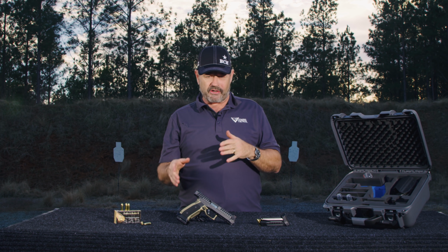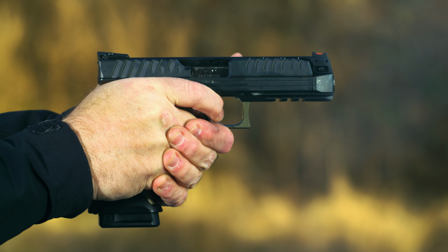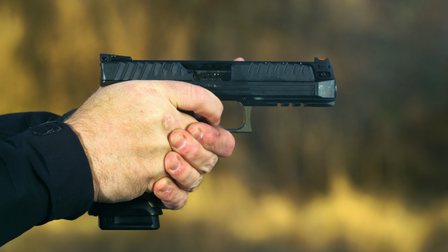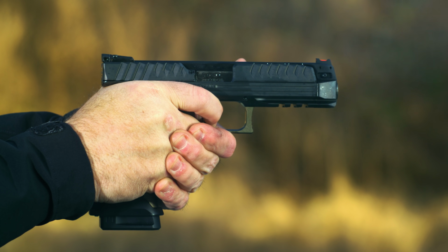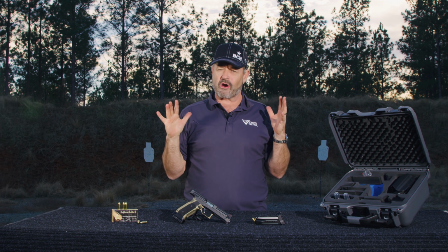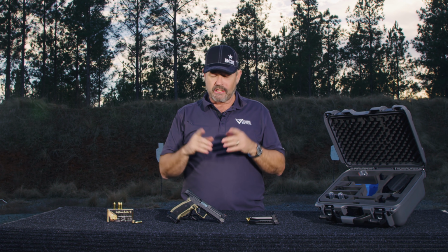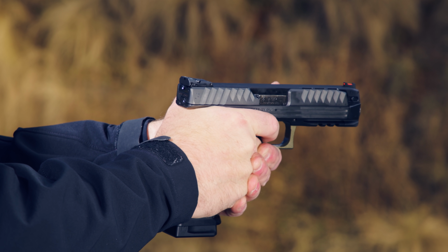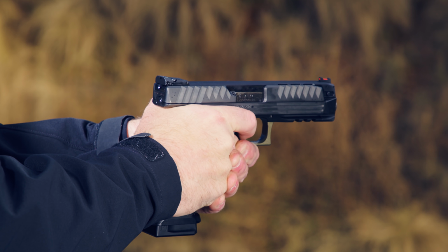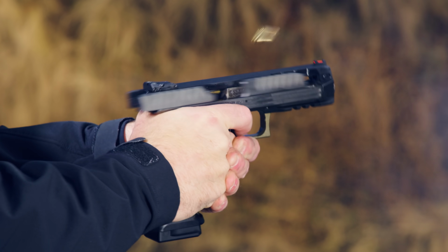A couple things about it. Fixed top rail has the hammer attached to it. So when you pull the trigger, you're actually pushing a rod up to release the sear, which releases the vertical hammer to come down and hit the firing pin. Very unique design, and the trigger on this thing is sensational, all right? Another cool thing about it is the slide operates below the sighting rail, and the sighting rail stays fixed. All right, it does not move with the slide whatsoever.